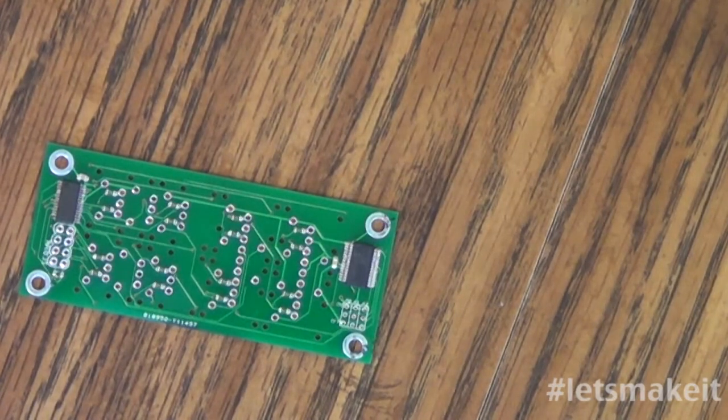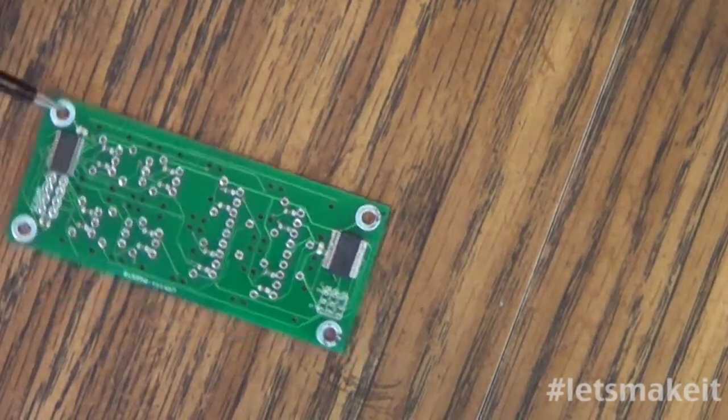And there are some parts of the board that will remain hot for a little longer than others. This board doesn't have a lot of copper on it, but the ones that are copper filled take a lot longer to cool down. And then in a second here I'll move it somewhere else on the table. 125, so I'll go ahead and move it somewhere else just to help get a cool area, because that area is really warm.